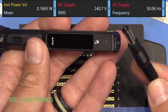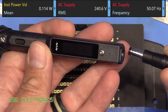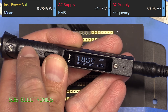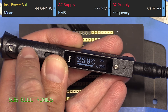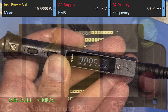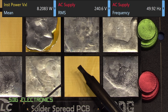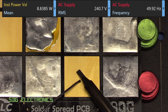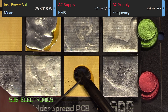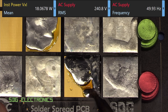According to the instruction book we can also power this with a DC adapter. I've got a 24 volt DC adapter here which should allow this to run up to 65 watts. Looking at the top, we can see the instantaneous power — we're getting about 45 watts, which is an increase in power even if we're not quite reaching 65. Setting 350 degrees C, putting solder onto one of these gold pads — it's just a double layer PCB with no thermal vias, so this should be fairly straightforward. It does flow quite easily, though there is a little bit of resistance compared to some other soldering stations, but it does melt the solder quite nicely onto the large gold pad.